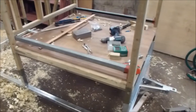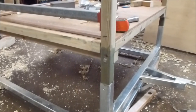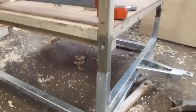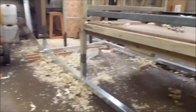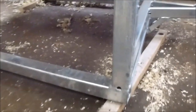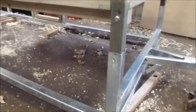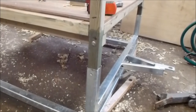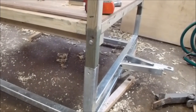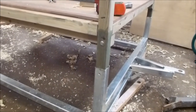The woodwork sits in these sockets which are welded in. It's basically two by two tanalised wood — we've got long ones here, the others are only 150mm, half that length. The bottom of each of these sockets has been left as a drain, as you can see. The wood is actually standing up on a small block of tufnel so it doesn't sit in any puddle of water at the bottom. I've done everything I can to stop these posts rotting, and hopefully it'll last a good few years before it needs any kind of serious repair.